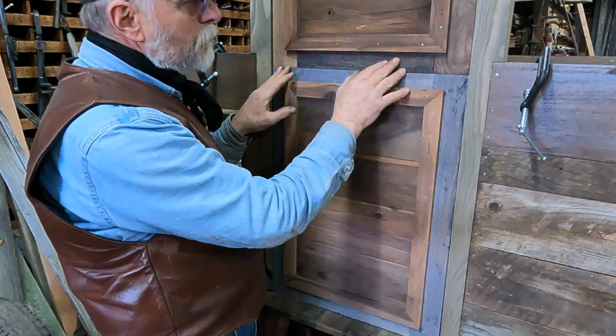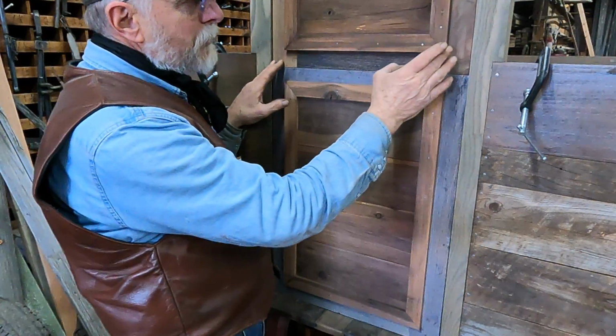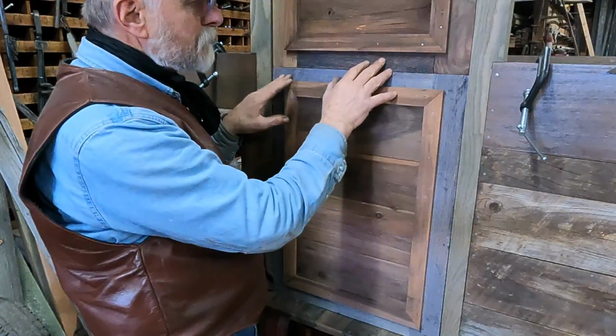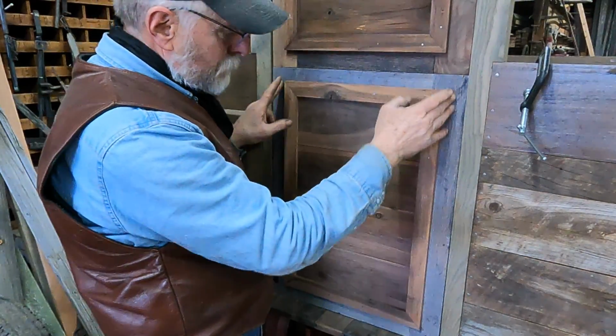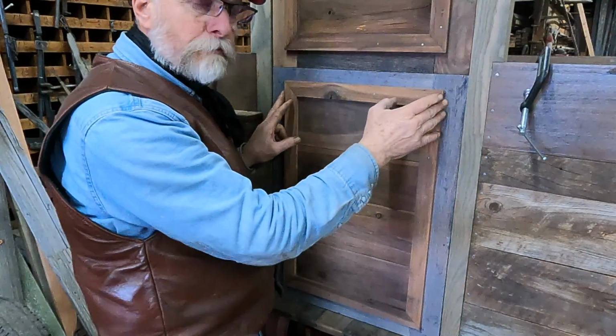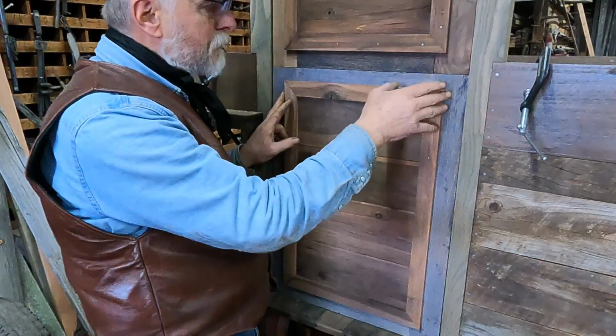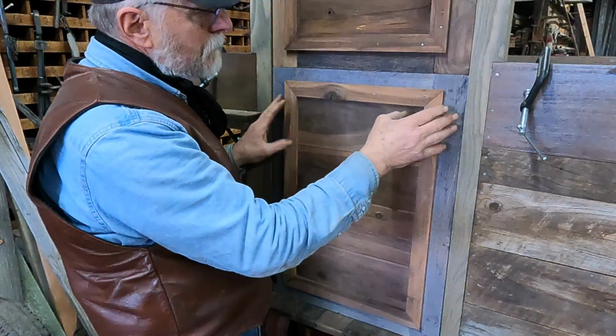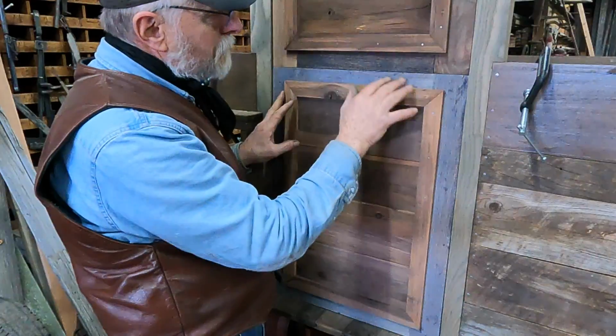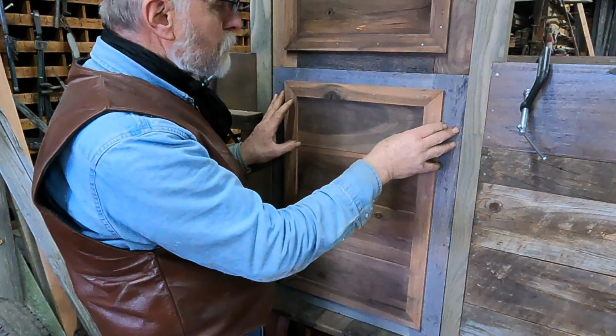This one here was a piece of oak. When I put that vinegar metal filings on it, because of the metal filings, it turns this oak really black. So on the bottom framework, I used a mixture of tea and this iron oxide crystals, and it gave a nice gray tone. Otherwise, it would have been black like this top one, and I really didn't want that black.